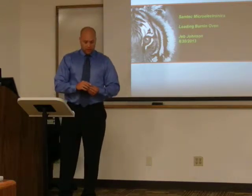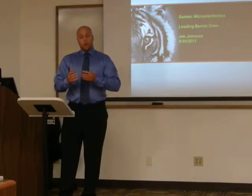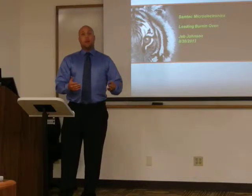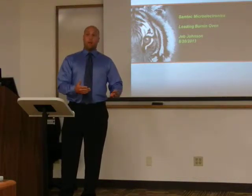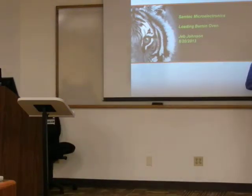What we are attempting to accomplish with this process is to, like I said, get it into a stable state. Meaning as the part ages, it starts to wear out, but in the early part of its life, you have a high fallout also. This is a high fallout rate, obviously a low, and this is over time. So in the beginning of life, we have a high fallout, and over time, we decline and start to level out. Towards the end of the life, then we start seeing it increase again.